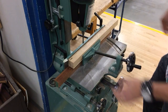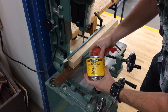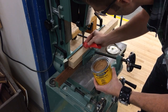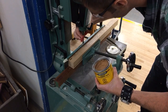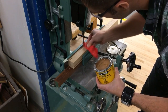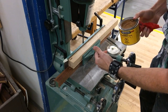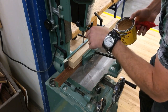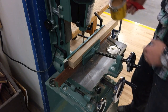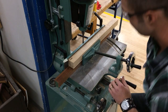Before I actually turn this machine on, I'm going to take a little bit of paste wax with a rag and rub some on the chisel. You don't need a lot. This really helps the tool cut smoothly — it helps keep the bit a little sharper by reducing heat buildup, and it allows the chisel to go really nicely down into the wood and back out without sticking, especially in a harder wood like this oak.